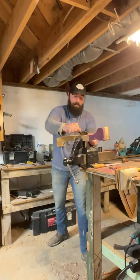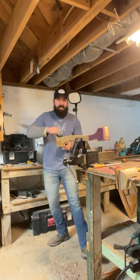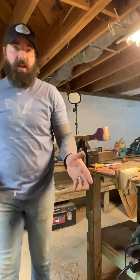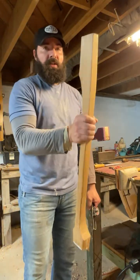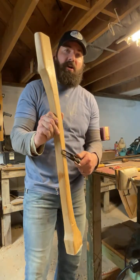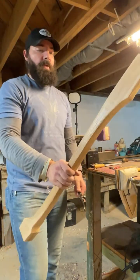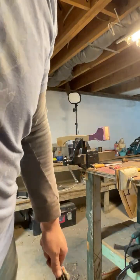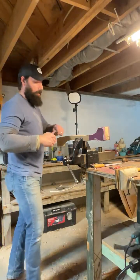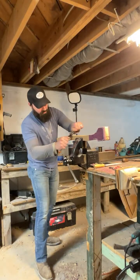It's already only 1 1/8 inches, so it's not like I bought a board from Whiskey River that's a 4x8 or 8x4 and you've got to thin that down. I've got an example of that right here. And it's still gigantic. The shape is good, but there's so much work to be done on the sides of these that if you don't have a bandsaw or a belt sander, you're up a creek. You've spent all that money on shipping and on that board, but you can't do anything with it without months and months and months of work.